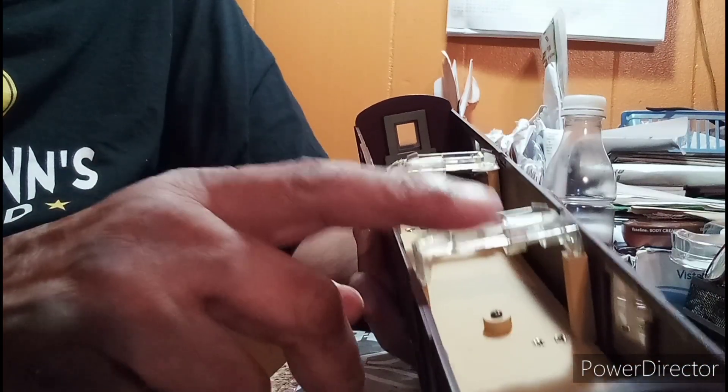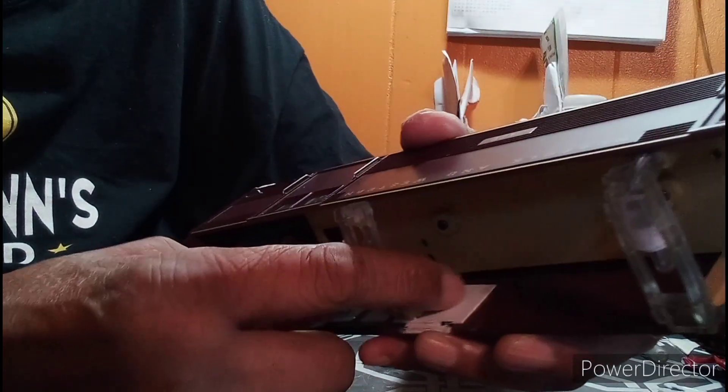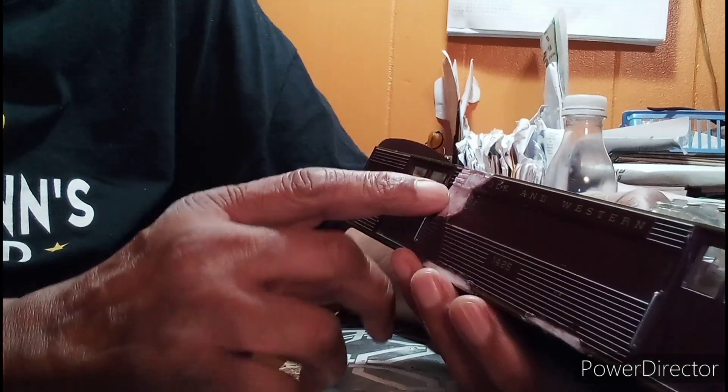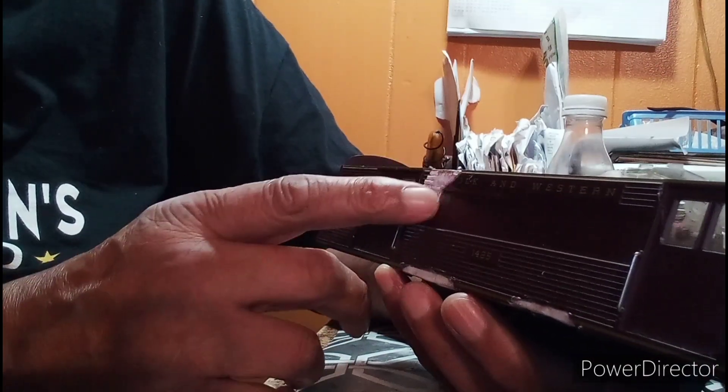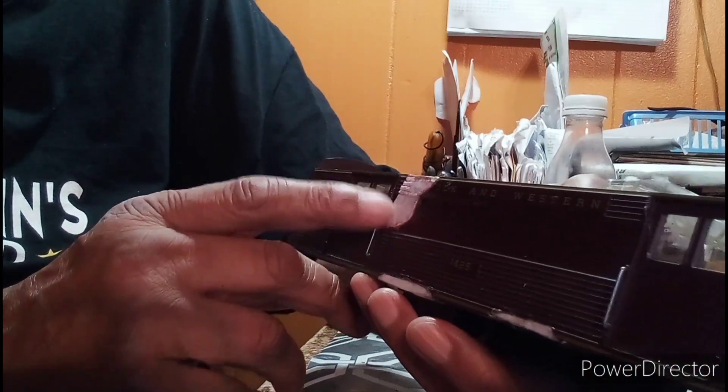This now is going to sit a little lower than this one, but it's still going to be okay. This piece here was all broke out — big hole there. I went inside and I made a plastic plate, covered the hole from the back side. Then I made another piece that went down in the shape of this hole, and then I made another piece and put on top of that so that I would reach the thickness of the original shell. So this is actually three layers of this plastic.